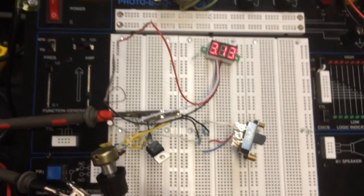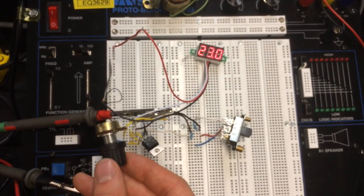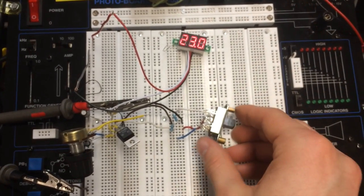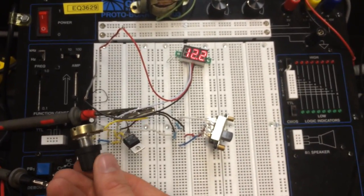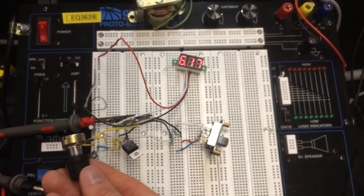Here I want to test the switch between the 12V range and the 24V range. Right now we're in the 24V range, and we'll confirm the accuracy of our monitor on the multimeter. And when I flip the switch, it drops to a maximum output of 12.2V, and here we can adjust with more precision.